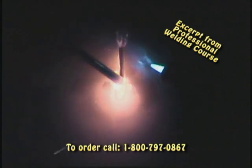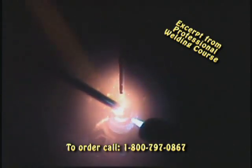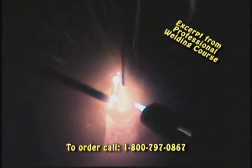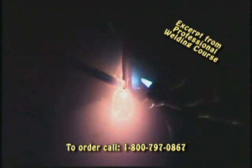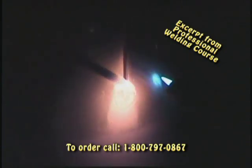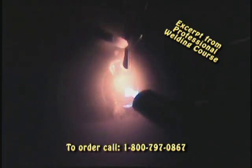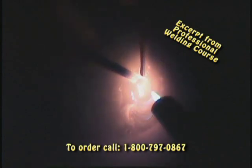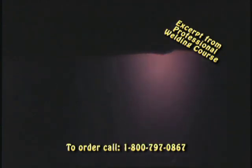So you walk it in, walk it out, just keep going. I put a little tack in there ahead of time so my plate wouldn't walk. Pull out with my hand so I can get a little further away from the rod, and I'm manipulating it up. If you get too much heat, just move the rod, move the puddle, move the torch. It's in the manipulation, folks. It's not dropping, it's not sagging, it's not going away. You can do pretty much anything you want — just keep the puddle going just as if it was in the flat. That's a 3G vertical up.